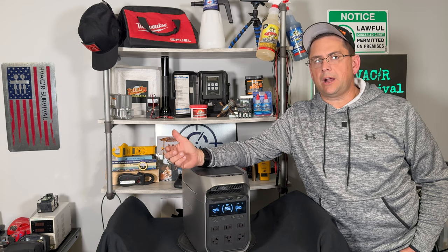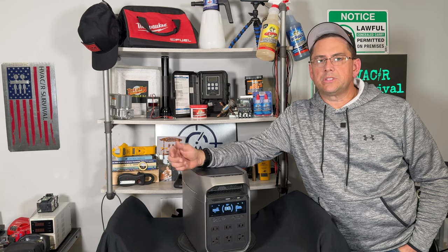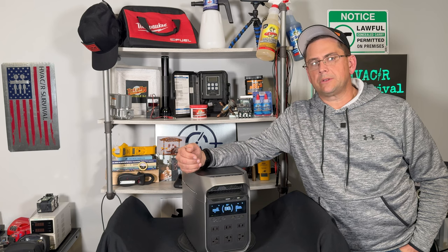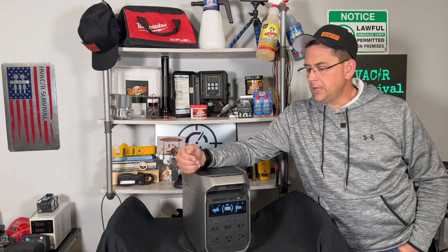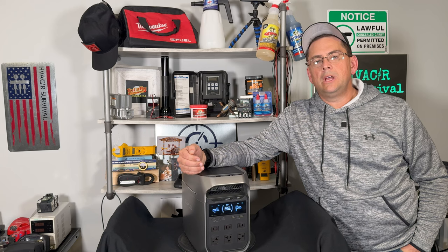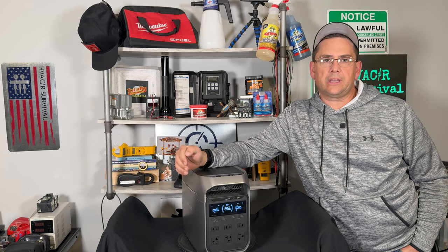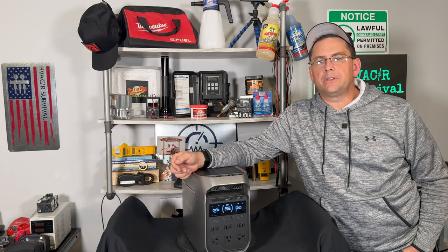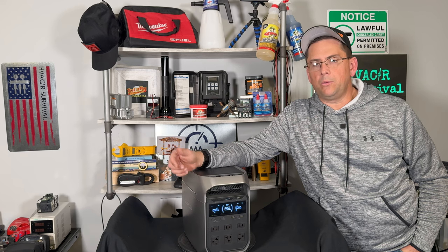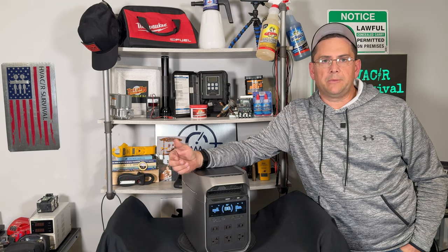The generator pretty much takes two tries to get it started, which is not too uncommon. It communicates with the power station via Bluetooth, and once that's connected everything works. When these are provided for review, a lot of times they don't come with an owner's manual yet — everything's still in prototype mode. Even though the equipment was provided to me to test and mine to keep, I'm not paid to do the review, so I'm free to give my own opinion — like mentioning the feet on the bottom of the generator were a little slippery. They don't recommend running the generator inside the garage anyway, so it should really be outside. That's how you prevent getting carbon monoxide into your house.